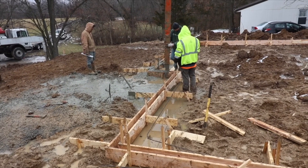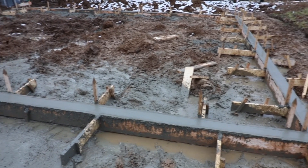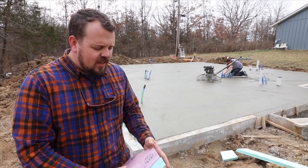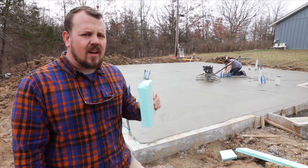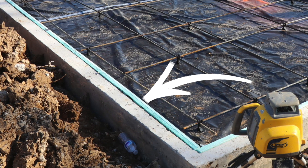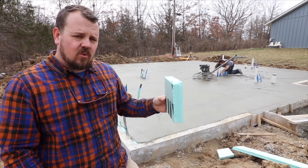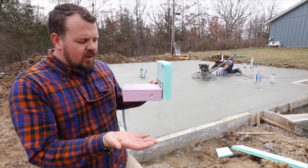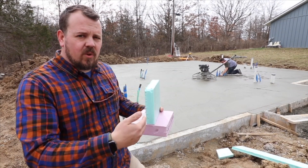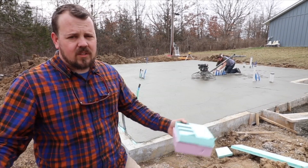So what we've done here to mitigate that is we poured that trench footing, and then our concrete guys poured a curb around the perimeter. That was formed with two-by-tens — it's four inches wide. On the inside of that curb, we added an inch and a half of XPS foam on the vertical. Then on the flat, at the four-inch point moving down, we added two-inch XPS foam. That allows us to have insulation on the horizontal and insulation underneath, so we're now thermally uncoupled from the ground and thermally uncoupled from the perimeter — and therefore from exterior temperatures, snow, or whatever is up against it.